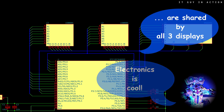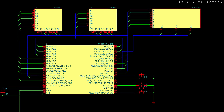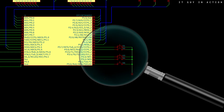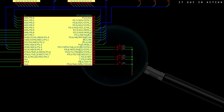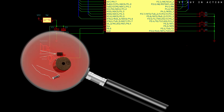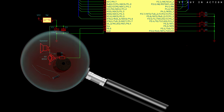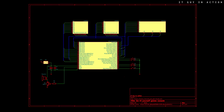Here as before, the whole image is not displayed at once but line by line — high speed makes the image appear solid. Plus we have several buttons to control the operation of the device; each button is connected directly to a microprocessor line. Finally, a piezoelectric buzzer with its own generator is connected by means of a resistor and a transistor, which here serves as a kind of switch that activates the sound based on the signal from the microprocessor pin.